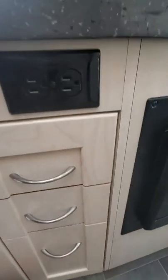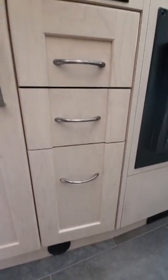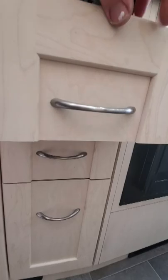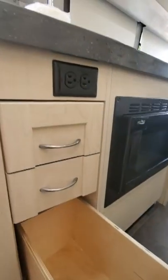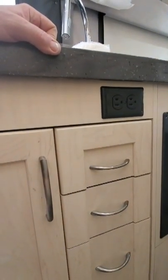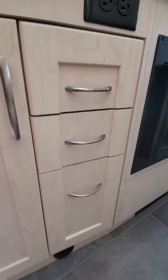Because I didn't want to have to match the stain again on this project, I simply took the right door and cut it as the face of each of the individual drawers. I think it actually came out kind of neat looking. I bought satin nickel pulls at Home Depot — about $2.50 each. I used side-mount rails from Home Depot, which I thought was important because with bottom-mount rails your drawer has to be a specific length since the rail attaches to the back of the drawer. With side mounts, your drawer can be an inch or two short — it doesn't matter.